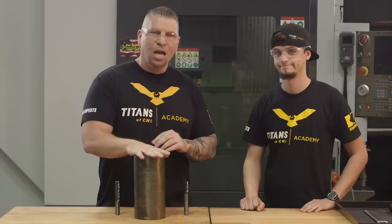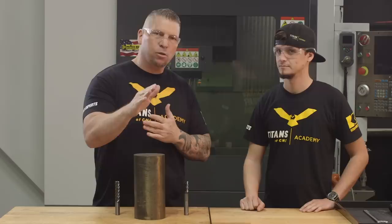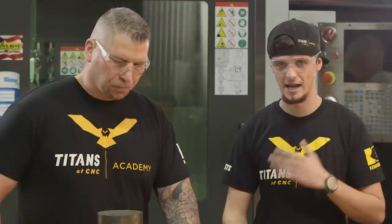Let me break this story down a little more. We have an awesome video out about Kennametal where we went over to La Trobe and did a whole piece on the company. Well, just days before that, I had personally programmed this job — put the speeds and feeds, the chip load, all of it exactly in the sweet spot from experience. Stuart had run the aluminum part, the setup, and everything was fine. I had to fly out to Pennsylvania, so he took the reins and actually started cutting into this piece. Within 18 minutes of getting my program and this piece, he had a broken end mill. This job is crazy — the material is crazy expensive, the end mills are crazy expensive. I don't want to have that phone call where I tell my boss we're going to go through three to four thousand dollars of tools just on the first part.